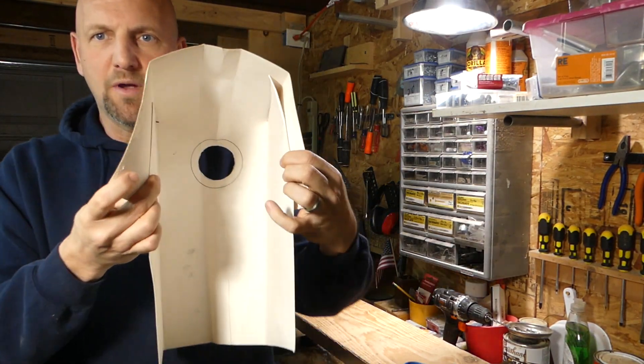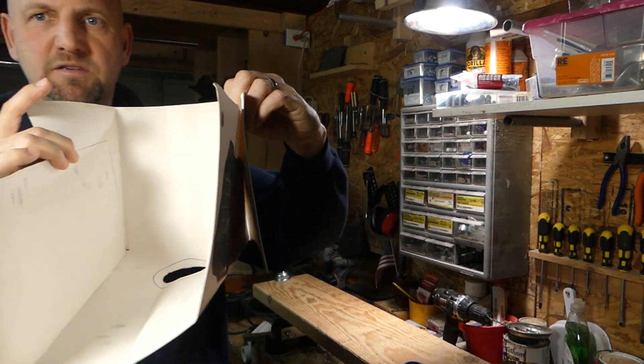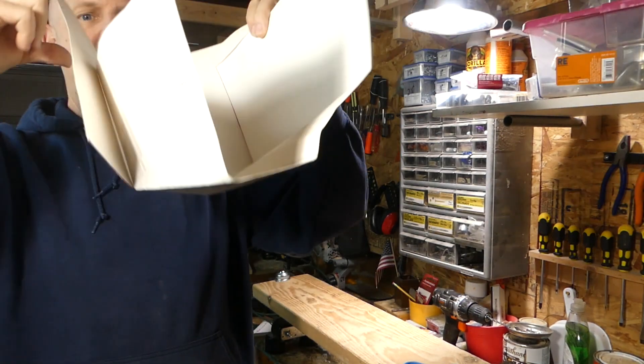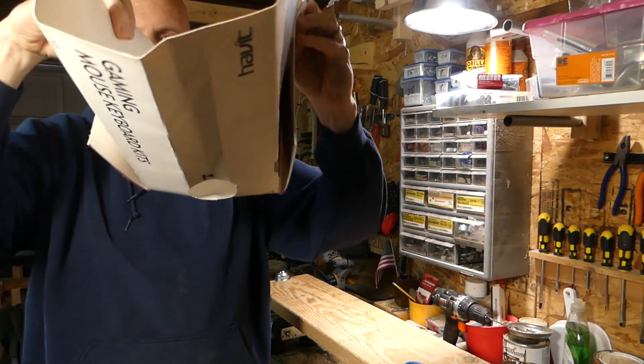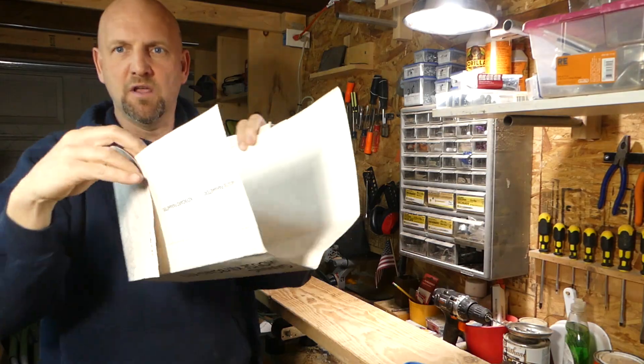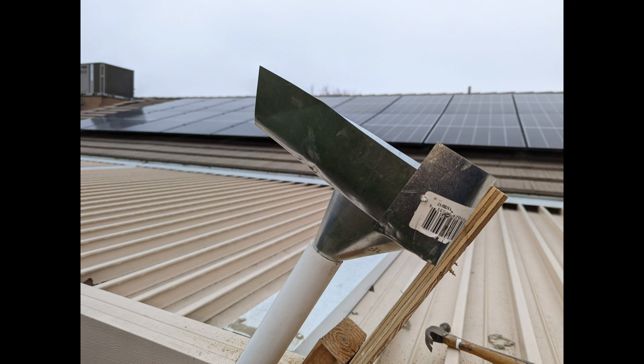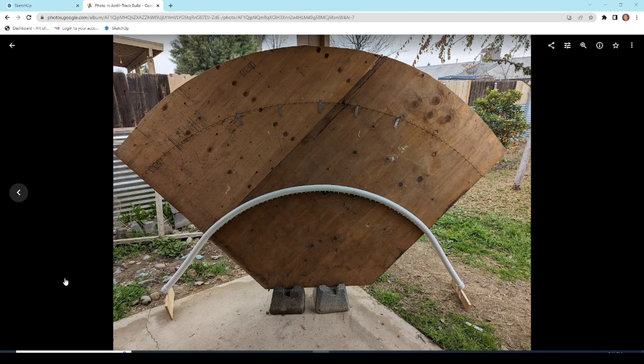When you're done you have a box shape. I used rivets on the sides of the metal to create the box, with a piece sticking out that I inserted into the top of the pipe. Then I hooked the whole contraption to a board so the pipe would slide up into the hole and pop into place on the jig.